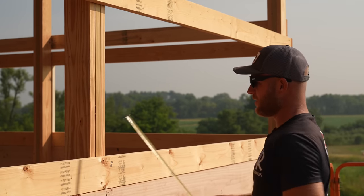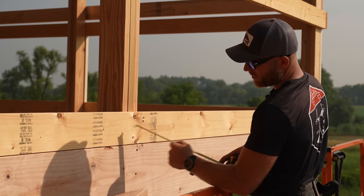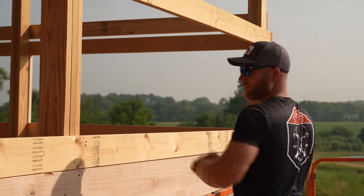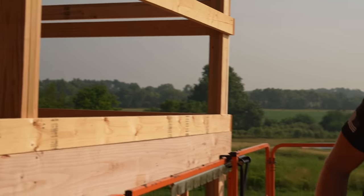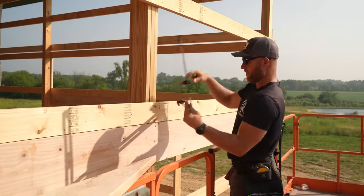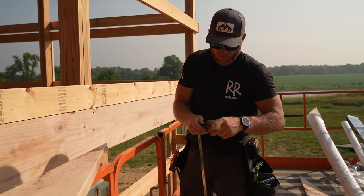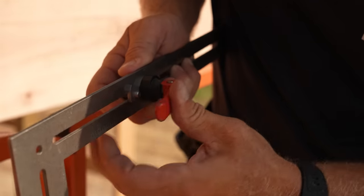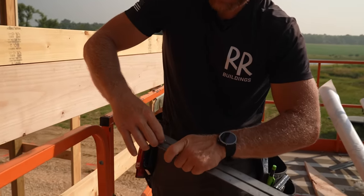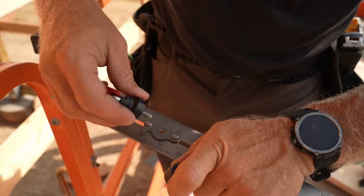If my math is correct, this should fit right in between these guys as long as everything stays perfectly parallel. What I need to do is — right here is the point where my fascia dies into the wall. My fascia is a 2x6 and this is the point where it angles back up to the gable. I'm going to take my Martinez square. It was backwards — I want it like that. Good time to show you guys how cool this is and how easy it is to set pitch. I flip this one around, it has a nice little push-button release.